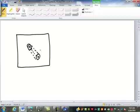Well, how do you drill that hole? You're not going to turn the drill to go at that angle. What you're going to do, you got your good old drill press here. You're going to tilt the table on the drill press, aren't you? You can tilt the head on a Bridgeport, yeah, but complicating things a little bit. You still can't do it all in one tilt.